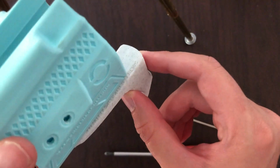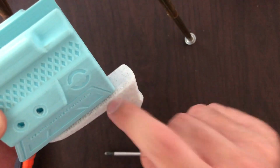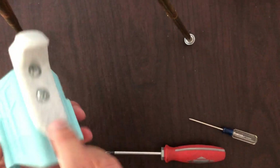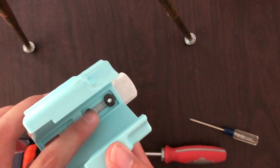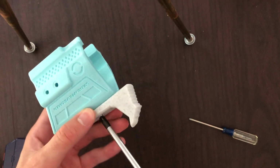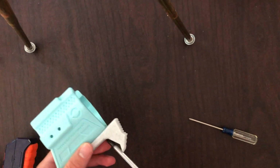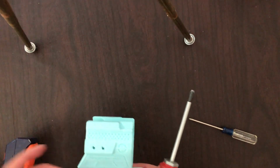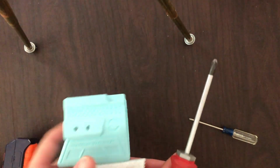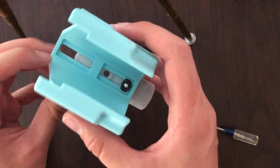Well, you kind of can't really see it now, and it's kind of hard to see anyway. But on one side, you'll see on the actual AFG, it says do not over tighten screws. And that's important because you're dealing with, of course, metal screws and metal T-nuts. And this system is really meant for steel, I imagine aluminum, polymer, plastics. So generally, this is stuff that doesn't give out very well. Unfortunately, this is 3D printed material, so the more you wrench down on this, the more the print is going to want to try to give out.